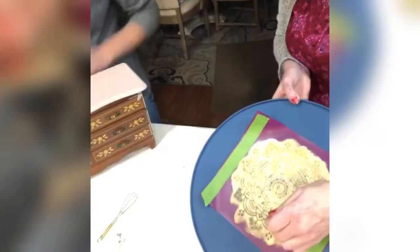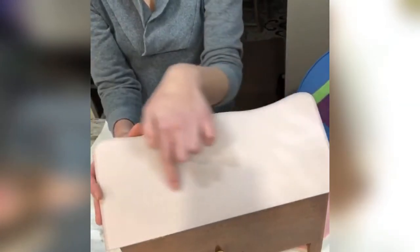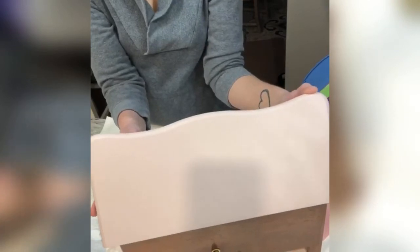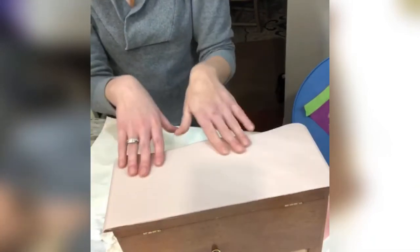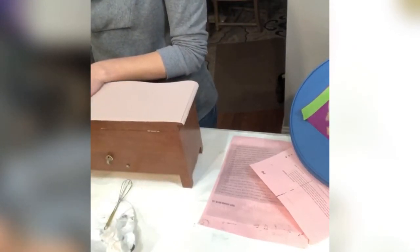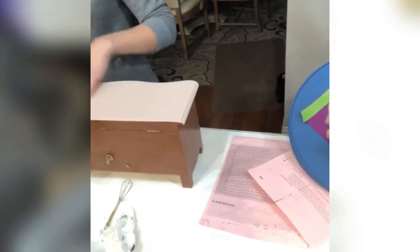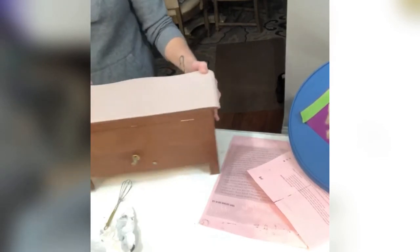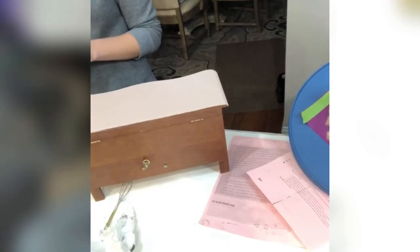How's the second coat of yours? As I mentioned before, I don't know if it's easy to see or not, but from overworking the paint, it didn't dry correctly because I continued to go back and forth. It's okay, I imagine. You can do a light coat over it. You can sand it with the steel wool, triple zero, or a very fine sandpaper, and then do another coat.